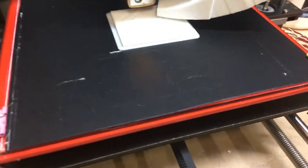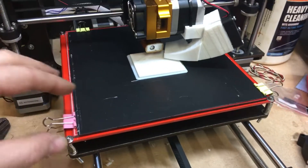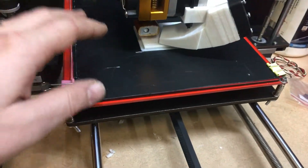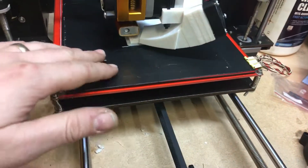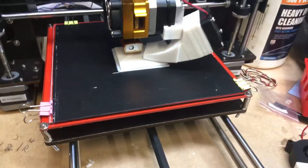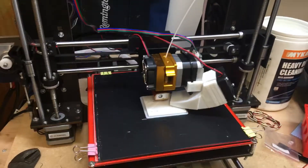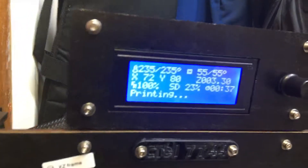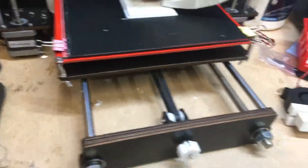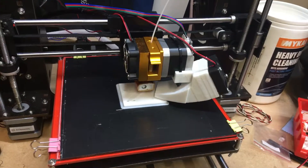Another problem I had when I first got going was build plate adhesion. This version came with a glass top held on with bulldog clips — I'm going to print some nice corner clips for that. I paid £3 for a stick-on build plate surface. If you search 'build plate sticker 210mm' you get a lovely square of this, and it really improved my adhesion problems. Make sure you preheat your bed — I preheat to 70°C to get heat into the glass, and my prints currently run at 55°C. I'll keep you updated as upgrades progress, and if you have any questions, fire away in the comments.